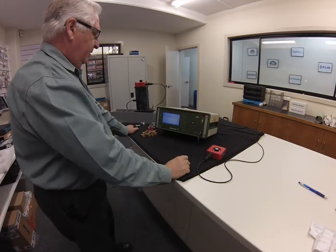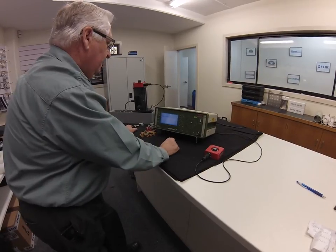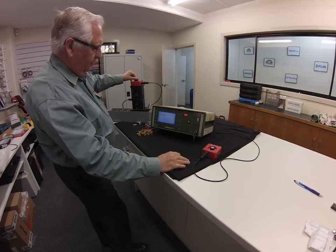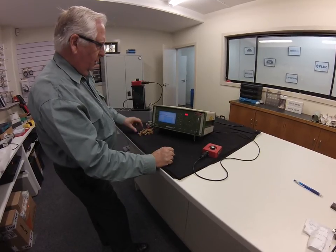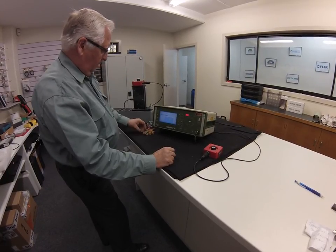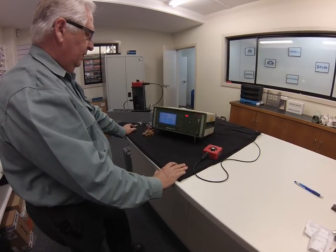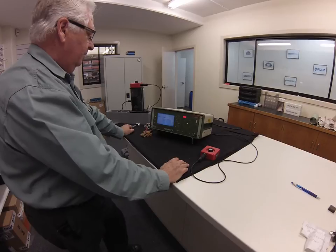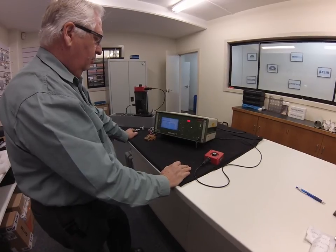So we get to the end of this period and we can see here that all of this has been done, and we'll put some more bad bolts in because we had exactly a 50-50 sort there. You can see here we've now got 13 rejects compared to 11 good components, and let's hope that in your testing that you won't have that percentage of bad bolts. So there we've got the results of how many components have been sorted as no good versus those that are okay, and this has recorded all of these results.